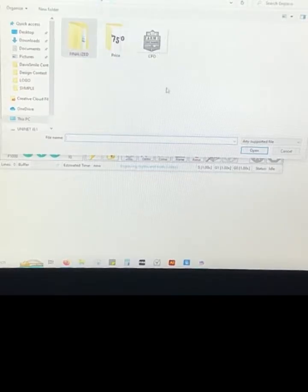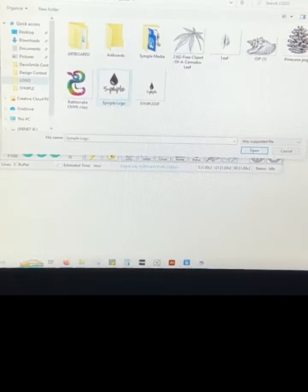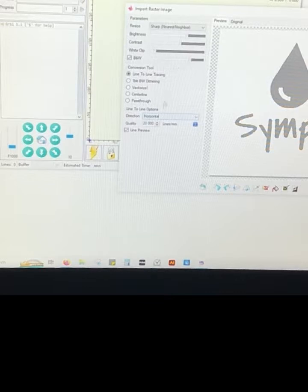These are all presets. We're going to go back — I want to show you something. We'll open up a simple logo file. There are a couple of different settings depending on what you want to do. There's vertical, diagonal, and horizontal. I've noticed that if you have a point at the top that the laser is going to go over many times — like on the vertical section — it'll burn that spot. So you have to check your logo and see what style benefits it best. I do horizontal for this logo.